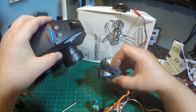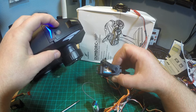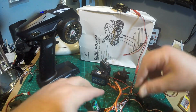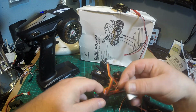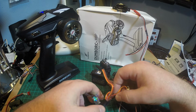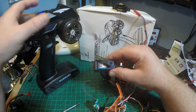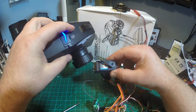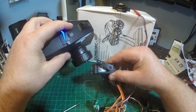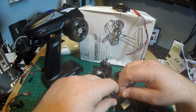But for me, I never intended to use two shifting servos. I intended to use maximum one shifting servo, and I thought, how cool is this? We have two more push buttons. So what can we do? We can use many more on-off switches to control lights, light controllers, whatever. But because the way of the servo travel is reduced so much, this signal and the way the signal tells the servo to go is not sufficient anymore to control a receiver powered on-off switch, and that's quite a bummer. I will show this to you now.